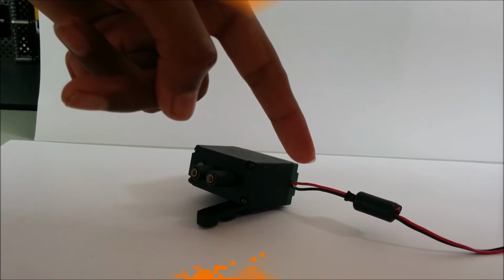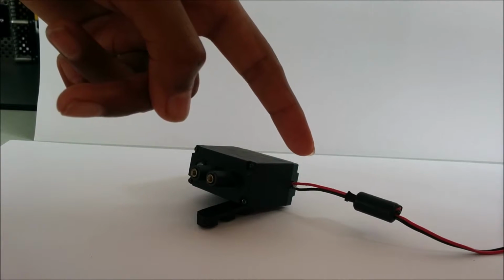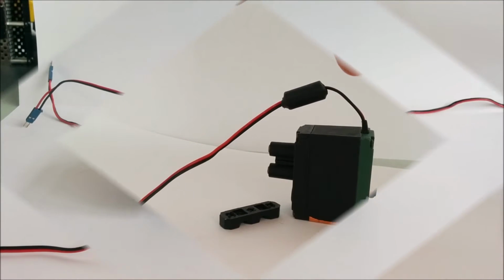When a 393 motor is used and the wires leaving the motor are bent too sharply, the insulation sometimes breaks and causes short circuits. This is avoided by gentle curves of the motor wires. This is an example of a reasonably curved wire.